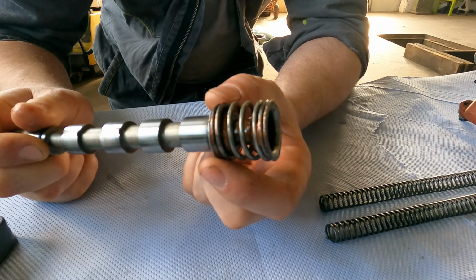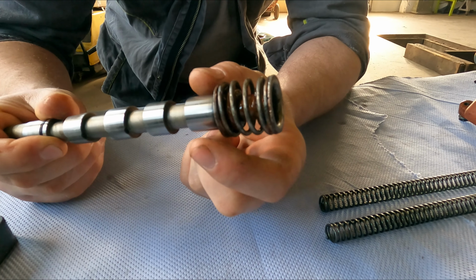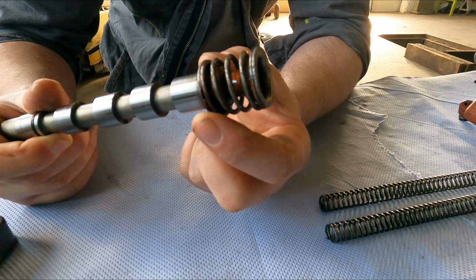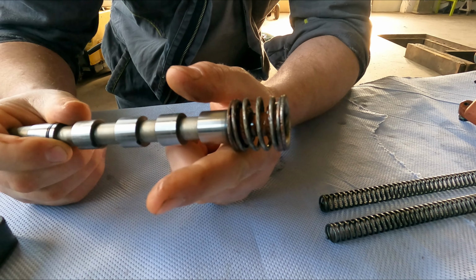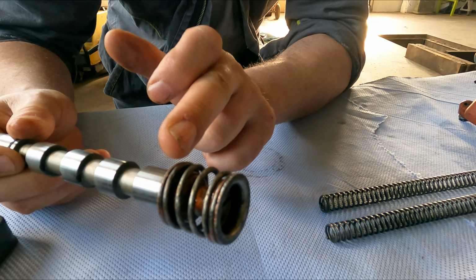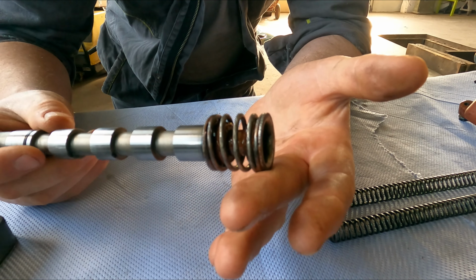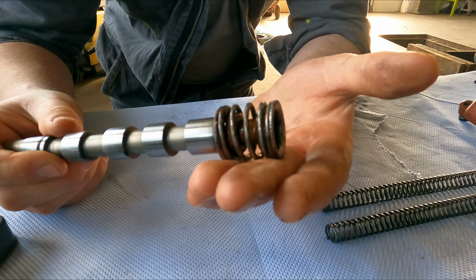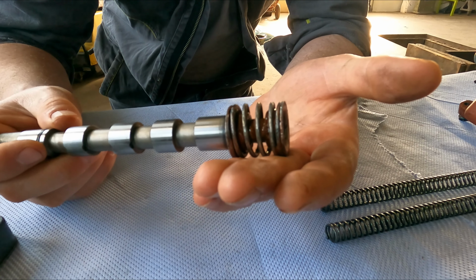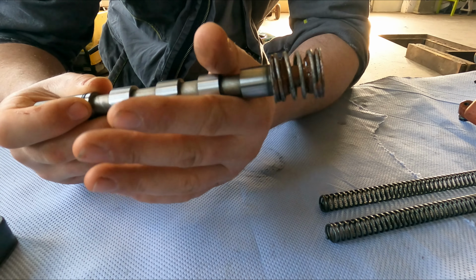And then just get fine sandpaper, wire wool, and just get rid of all this. And grease it up with copper grease between the cup and the valve body, and put it back together. And make sure that every now and then you give it a wiggle or a bit of a pull around in both directions, and it won't seize up.